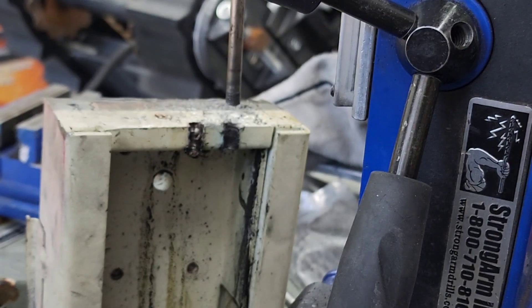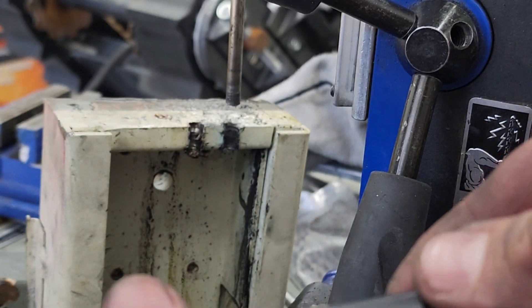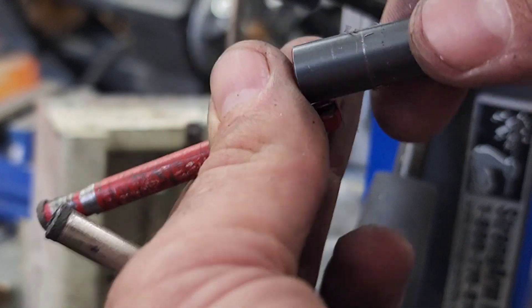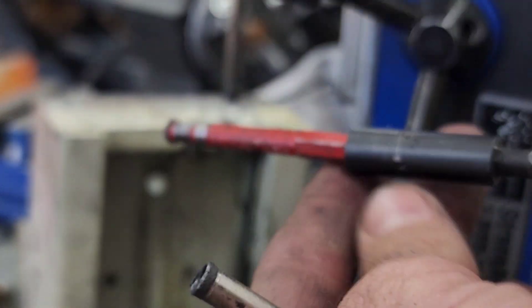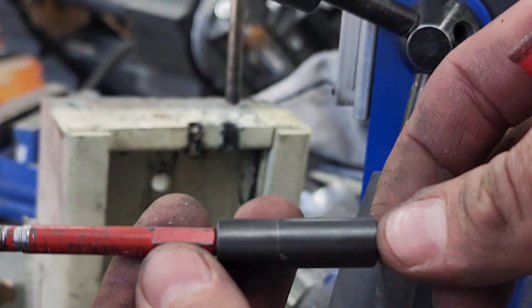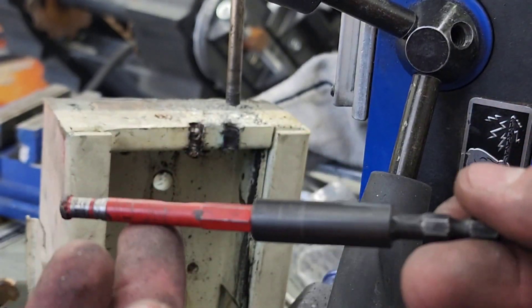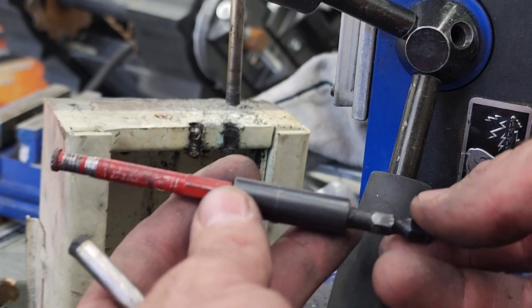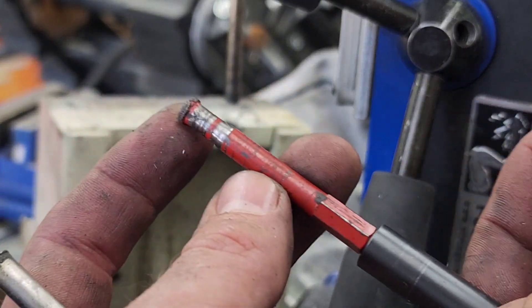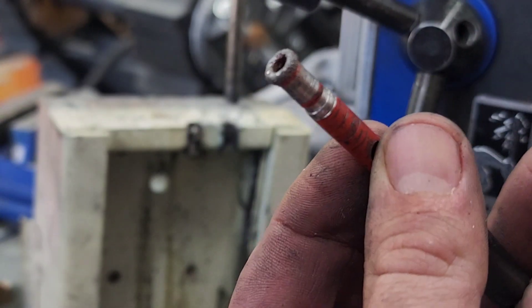If you need to get more depth with these drill bits, you can simply jump up in size and add these extensions. You'd be able to drill the skin of the safe wider here to meet up to 5/16ths or 3/8ths, and then attach whatever sized attachment you need to get down to the work area wherever you need it. I'm going to chuck this same bit that we just used to drill that first hole up again and continue to drill holes — basically run it to failure.